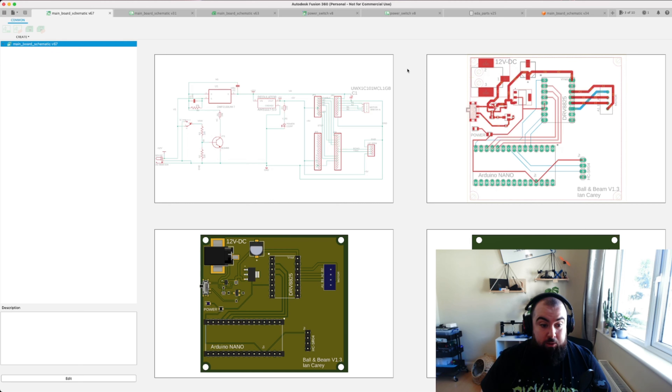One thing that's a little bit different with Fusion 360 is we can integrate directly with the 3D modeling power that Fusion 360 is so good for. You can generate these really nice 3D renders of your board that are native models in Fusion 360. So you can then take that model and add it to some other thing you're doing — if you want to design a case or enclosure for this PCB in Fusion, you can import this model directly and it'll all sit together nicely.